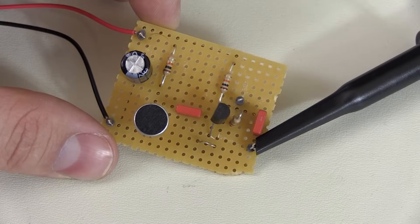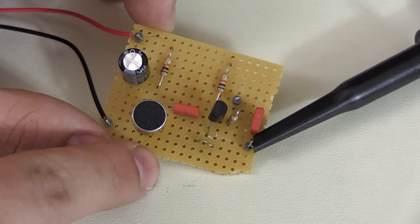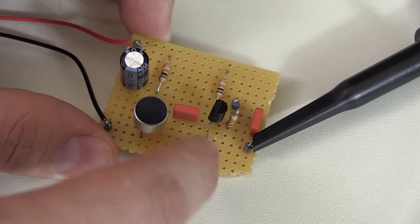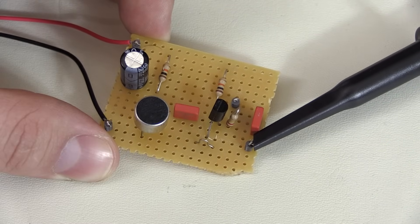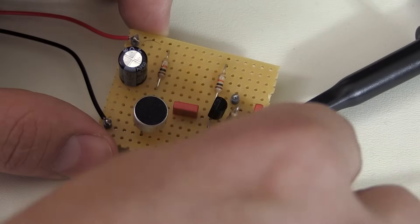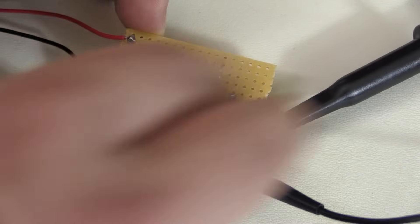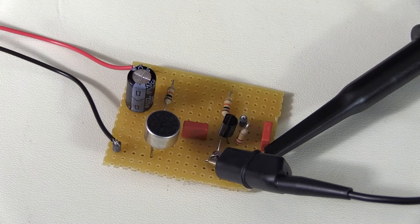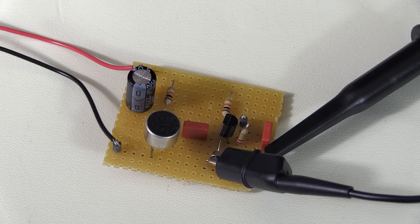I don't like soldering cables directly onto my circuits, and I don't like having probes connected directly to component legs. I always try to make sure my designs have a lot of these terminals that I can hook up to if I need it, and I do this pretty excessively. Almost any point in my circuit that's important in any way has a test point of some sort.